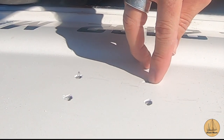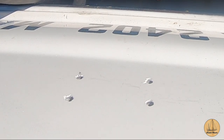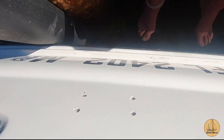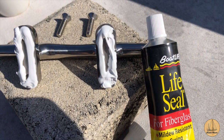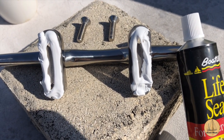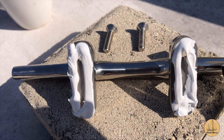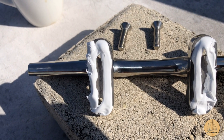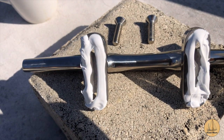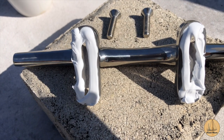You can see I cracked the gel coat right on that very edge there — that'll be all right. I like to use Boat Life's Life Seal for above-the-water sealant. You can see what I've done here: I've just run a small bead around the outer edge, and the reason I'm doing that is I want it to skin over a little bit so that when I apply pressure it sort of acts like a gasket. I'm going to put the screws into that cleat through the openings so they're kind of held in place as it skins over.